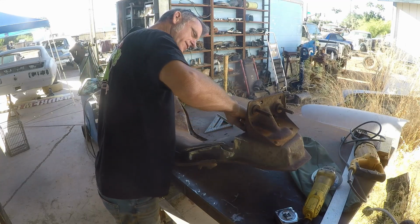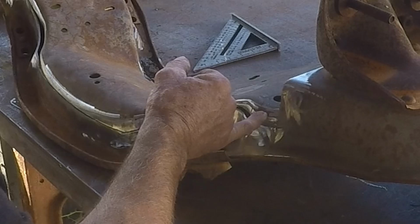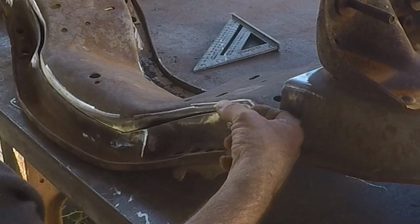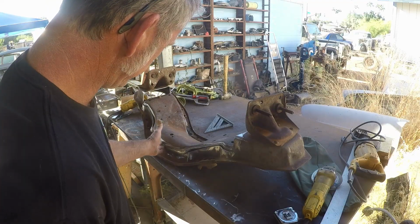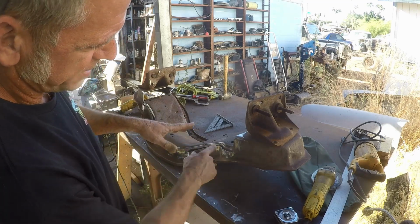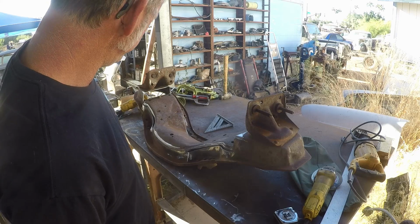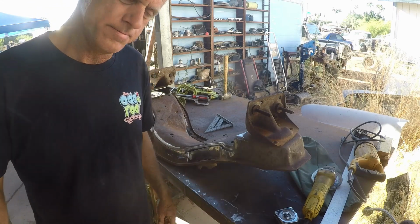What are you doing down there? Like Pete was saying, here's where we're going to have to do some relief cuts and then manipulate it back to where it's pretty much a whole straight line. Down here is okay. We already knew that this was going to be an issue, but it's because these angles were tapered. Anyway, no biggie. We've done that kind of stuff before.